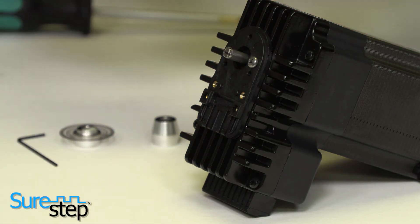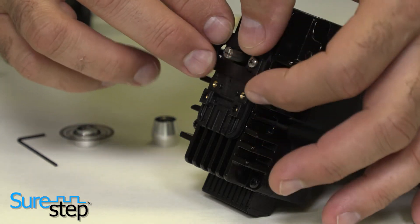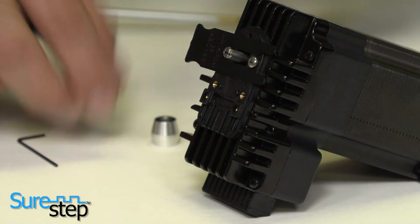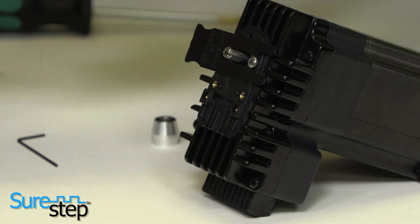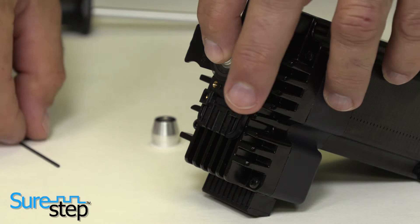Place the spacer tool around the shaft and the two mounting screws, unless mounting screws were not used. Slip the hub disk assembly over the motor shaft with the code disk wheel towards the top, until it bottoms out against the spacer tool.